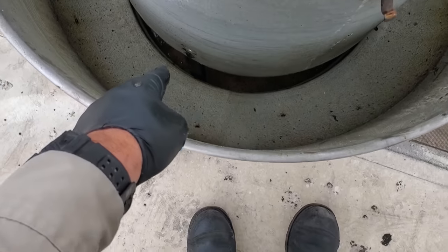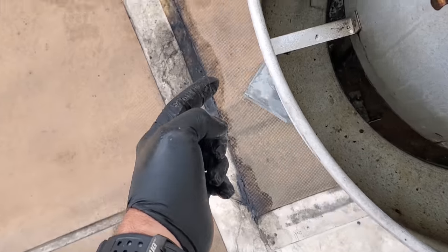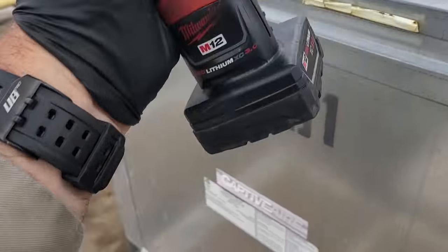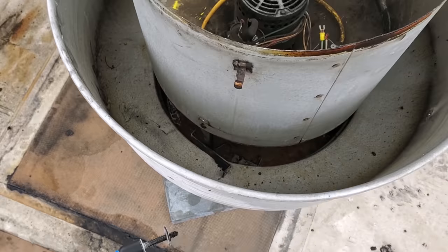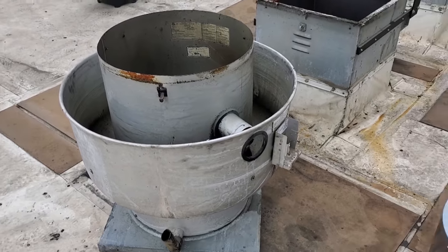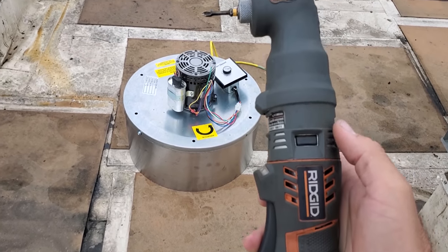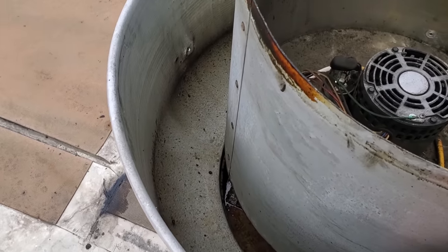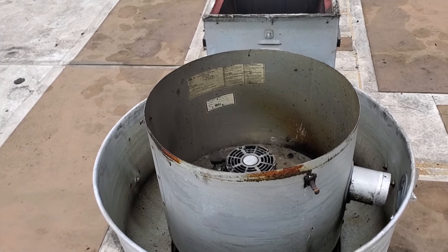We got it on the ground. I had to remove these support brackets — you need a 7/16ths and a 3/8ths nut and bolt right here, and then this is just a 3/8ths tech screw. Yes, I am getting pretty greasy. My tools are going to have to be totally degreased. It looks like there's another bolt down lower to get that whole top shroud off. I've had this multi-tool for years — it's like a convertible rigid thing with different heads that can rotate. This is an impact head, which works great because there's a Phillips head screw down in there.